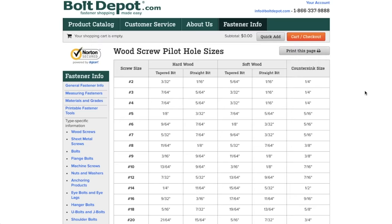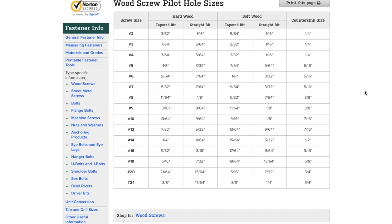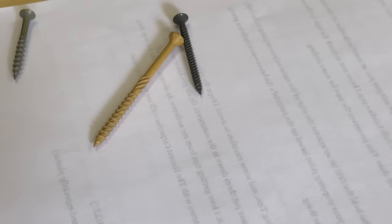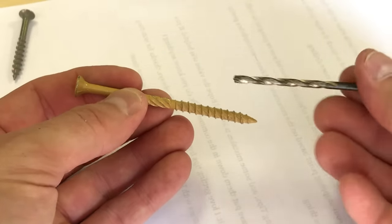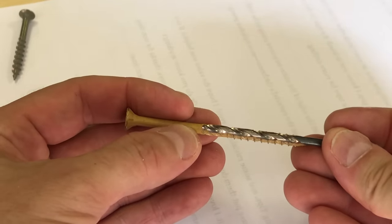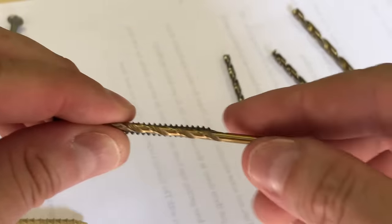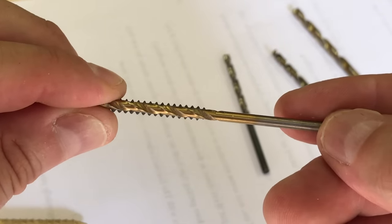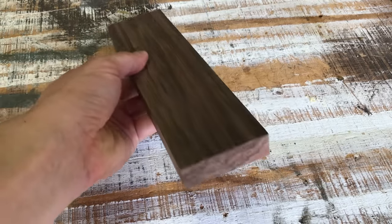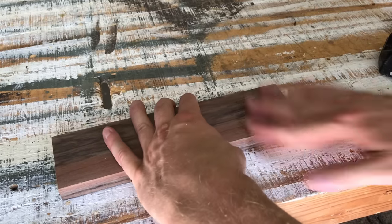I frequently get asked: how big should my drill bit be compared to my fastener? There are charts out there, but here's a quicker, more convenient trick. Tip number eight: the eyeball method. Take one of the fasteners you have to drive and hold it out in front of you, preferably against a light-colored surface to create more contrast. Take a bit and hold it closely in front of the screw so they're basically touching and in line. Ideally, you want the drill bit to hide the shaft of the screw but not the threads — the threads are the cutting agent for the screw and carve the channels that hold it in place. So you want the hole to be about as wide as the shaft, but narrower than the threads. Also remember that hardwoods like walnut will require slight overcompensation — you may want to cheat up to a slightly larger bit size to remove just a little more wood.